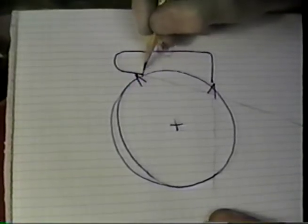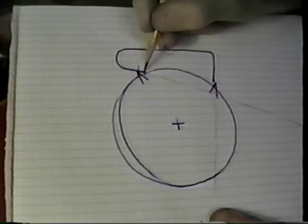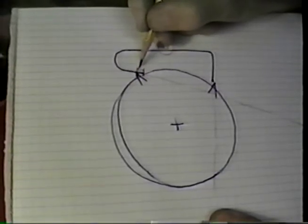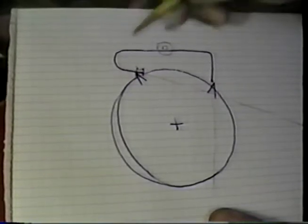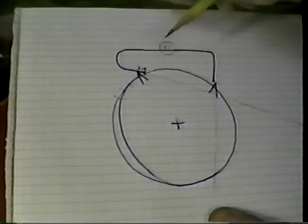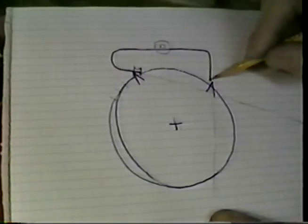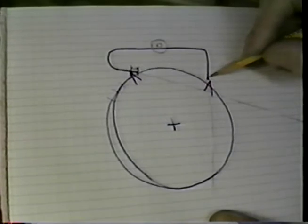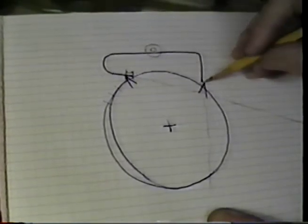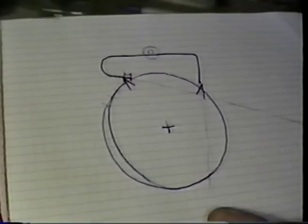If we make this distance, let's say this is the landing point when we enter this pallet, if we make this distance right here about 75% of the tip-to-tip spacing between our teeth on the wheel, then this tip here should be just clearing inside of this tooth. This should just pass in as this tips up. That's a judgment position that we have there.